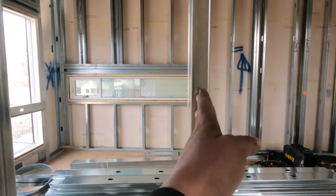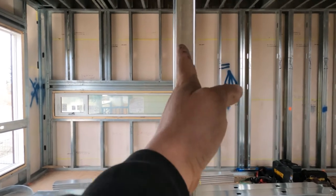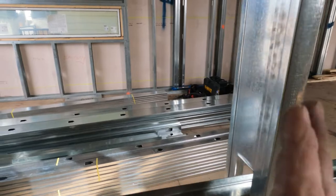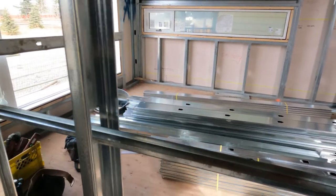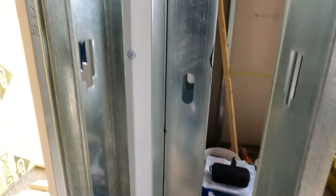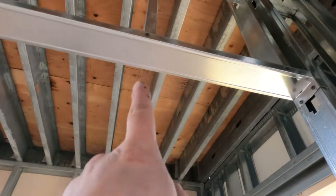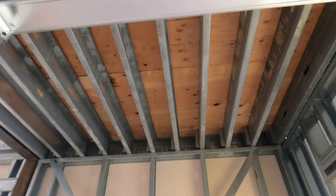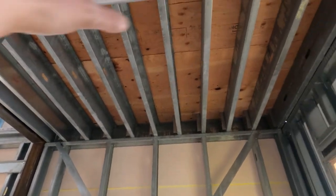This is kind of what I'm trying to show you here — you slip the drywall in the ends and you want to join in the middle, right in the middle there. That's going to be super easy to get your sheets in and easy for the taper to tape. On the front wall, you can put a joint at the top if you want, but what I would do is go straight across with a full piece.